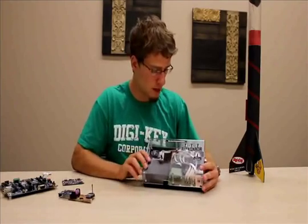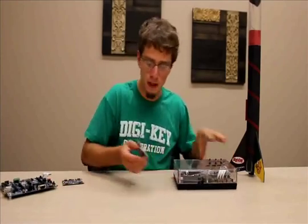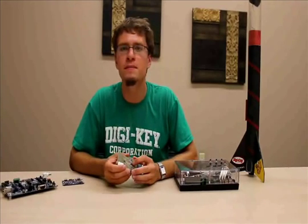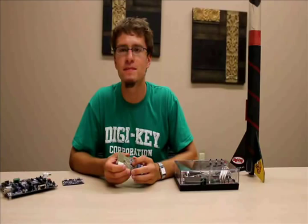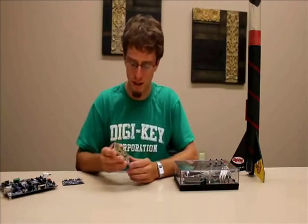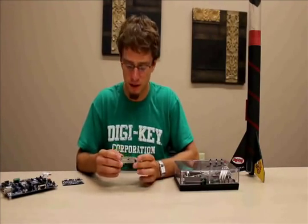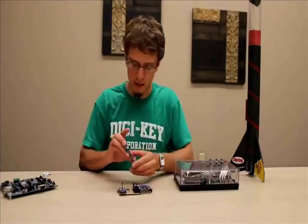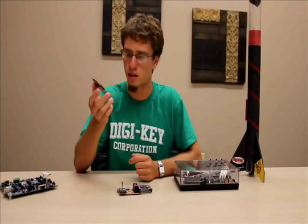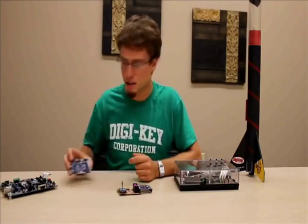This unit has a bunch of other stuff on it. Oh, by the way, this one has an Atmel chip. What was the chip name, Alex? AT32UC3L0. Okay, that was the chip there. And you use the design environment? AVR Studio. AVR Studio, okay. And this is a little dev board that he used most of the time to actually design most of the code and implementation that he did.